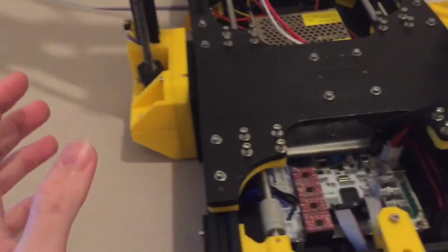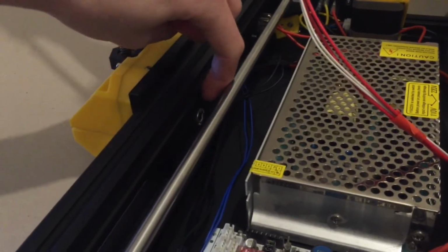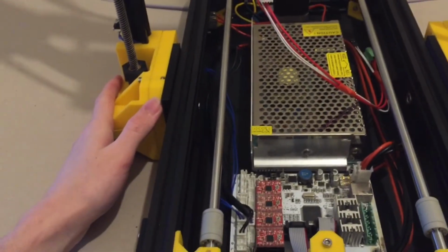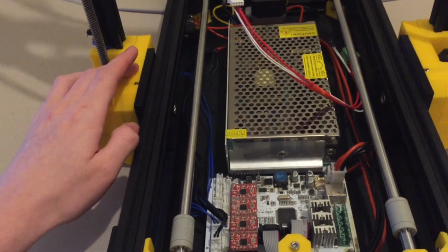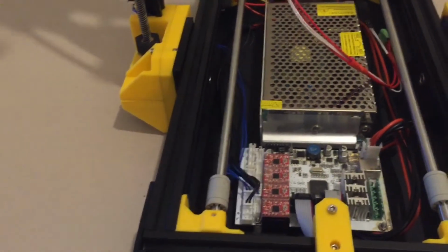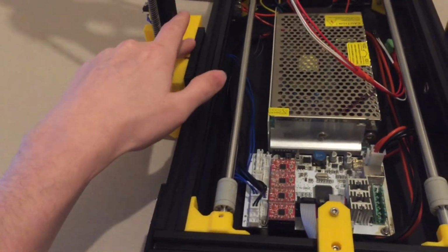And a few other things like that. One of the problems I have noticed is that these units, which allow it to fold, just use a nice big M8 screw, 30mm long, as the hinge, and a nylock nut inside here. Unfortunately, I'm noticing that every once in a while during testing, the screw is slowly coming undone, which adds some looseness to the system, and I think that's just because of the amount of friction within there.